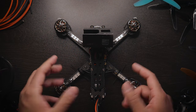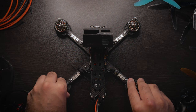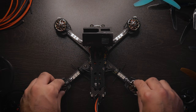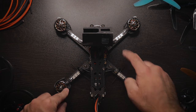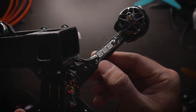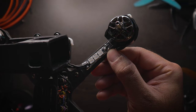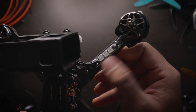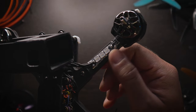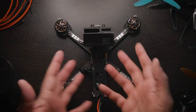My third tip: turn on your quad before you shrink down the heat shrink and apply heat to it. That way you know for a fact that everything is working properly — the lights are on, the motors are spinning in the right direction, and you haven't miswired anything. Everything is pretty one-to-one: the wire that goes in on one side is the wire that comes out on the other side, so just match the two wires to avoid accidentally reversing your motor direction.